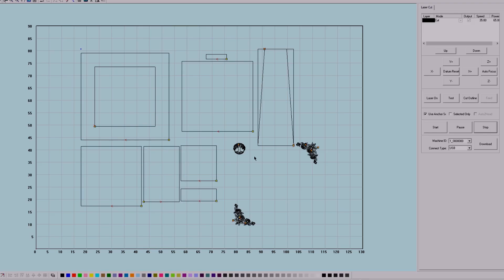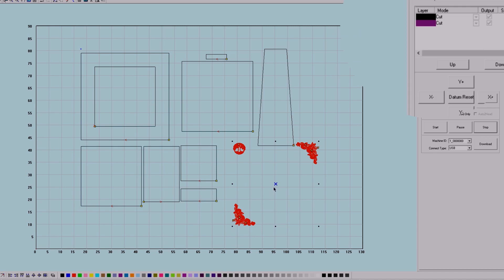I'm going to delete that because we want a slightly angled support for the frame. The base that is going to be laser cut we leave as is. The artwork will be engraved, so we need to change that — I'm going to select it as layer purple and move it into our frame area in the middle. We need to make sure we change our purple layer to engrave and not cut. Make sure your engraving layers are first and your cutting layers are second.